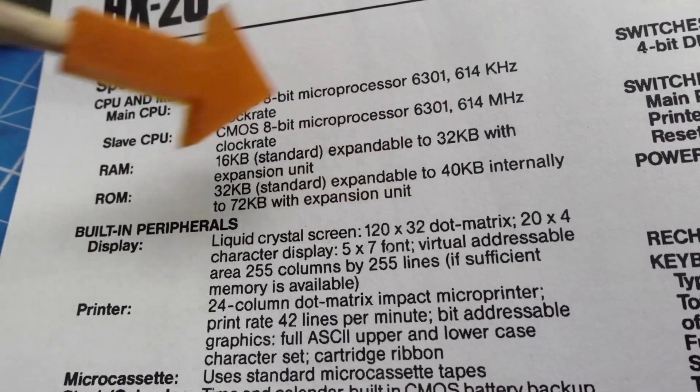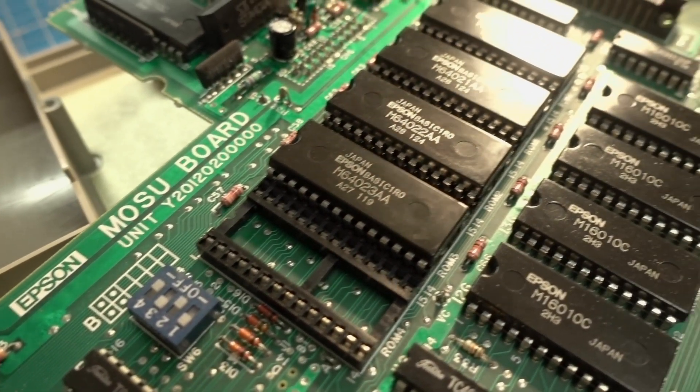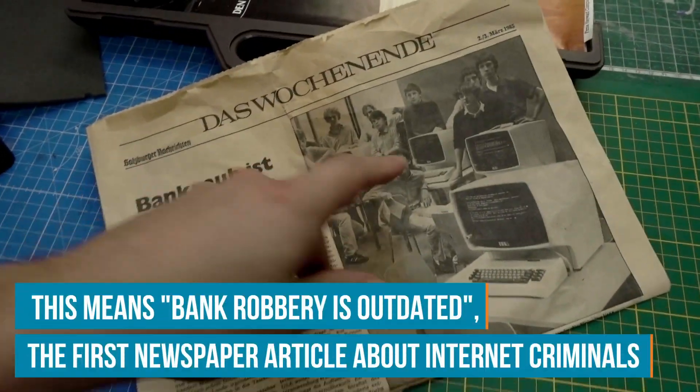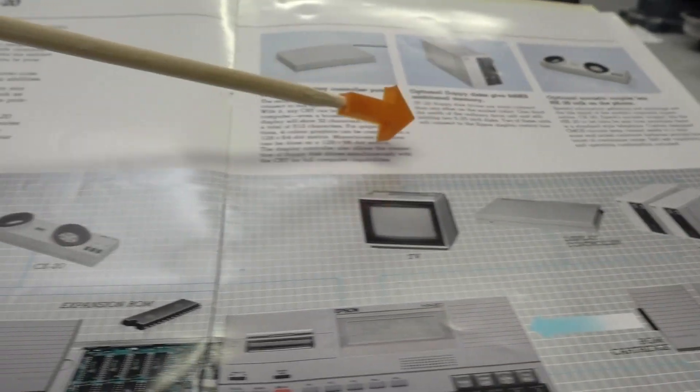There is a lot of RAM on the board, and there was a RAM expansion card you can install in there. There are also individual ROM chips containing the Basic ROM. There's a DIP switch that lets you change the language and even the operating system. Setting number four switches from the usual Basic — which uses only the internal screen and peripherals — to disk Basic, which loads from an attached disk system and enables an external CRT monitor with graphics mode. Building a compatible terminal to use that graphics mode would be a really cool future project — leave a comment if you'd like to see that.